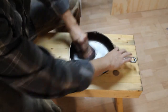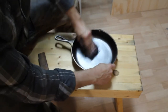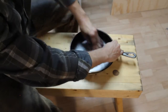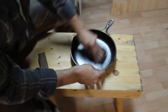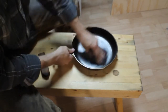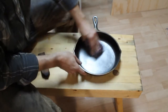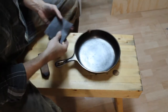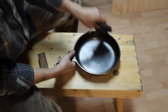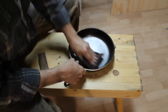Right now I'm focusing on the center - I was working on the outside couple inches of the skillet first. I'm really liking what I see in terms of scratch patterns; it's nice and uniform, it doesn't look sloppy. When I sanded this with the angle grinder and the scotch-brite style pads the scratch pattern was definitely not uniform, and I wasn't hugely happy with it but left it as is. I think I'd be much happier with a uniform finish on the finished product, and so far that's coming out pretty well.